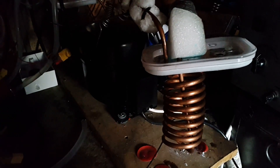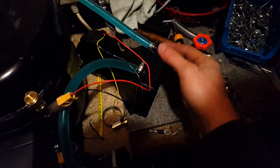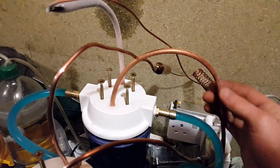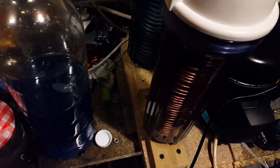Once I get my needle valve I'll basically be able to set it to any temperature. And this is it, sort of in its final form. I've got a little radiator on here blowing really, really cold air — in fact it's getting so cold there's ice on it. The antifreeze is well sub-zero because the liquid returning to the compressor is freezing up. The condenser side is getting quite warm — I've not got any cooling on it just now, but I'm just testing it. What I will do is get a bigger heat exchanger for the cold side, put this on it, and that'll make a good air conditioner. For the hot side it'll probably just be a big bucket of water sitting outside.